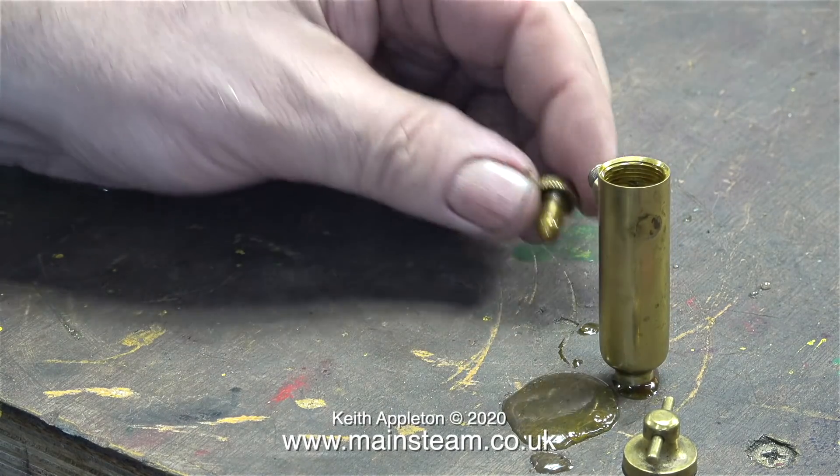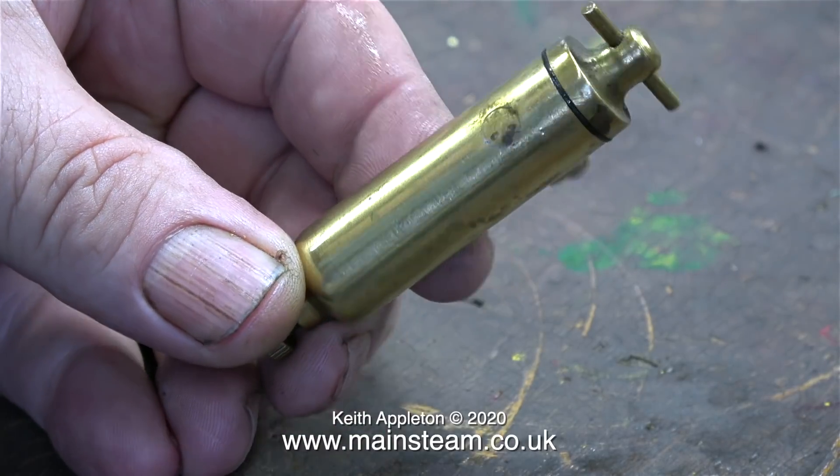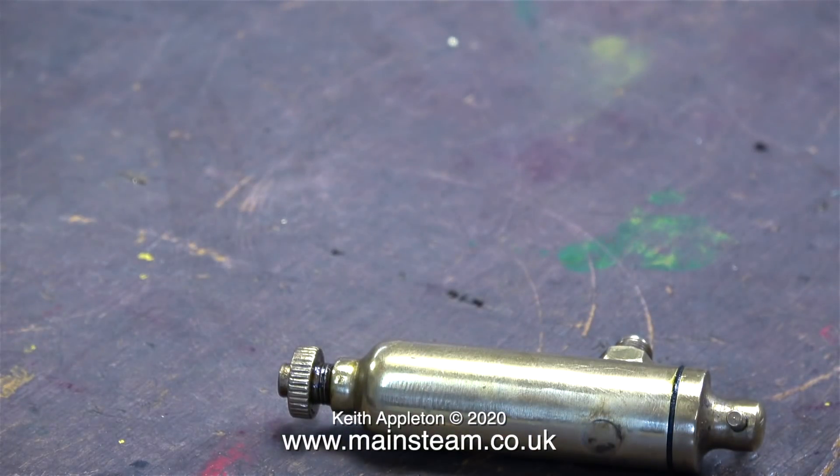The part I've just removed is actually a valve — you don't take it out all the way. When the lubricator is in service you just open this valve, which first of all clears the water, and when you see oil running out of it you close the valve. Then before replacing the lid you top it up with steam oil, which is very thick and gloopy stuff.